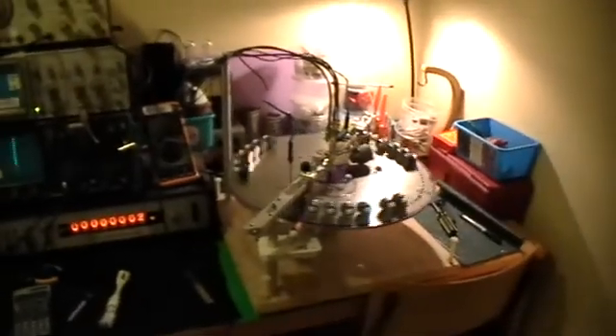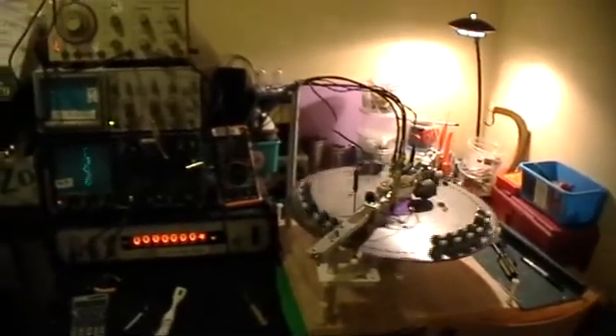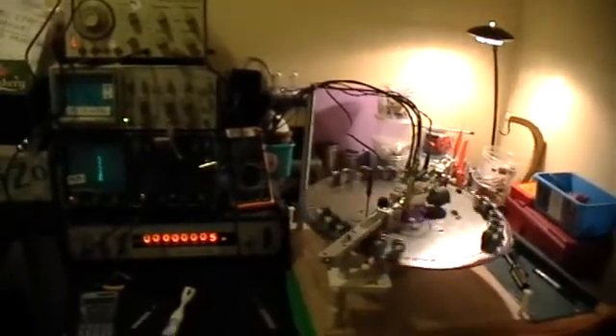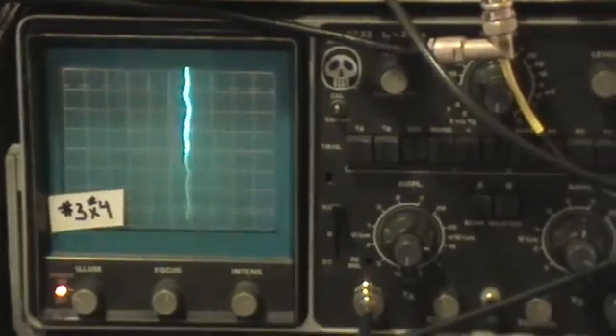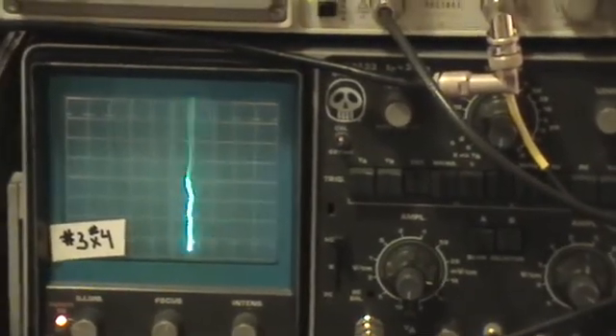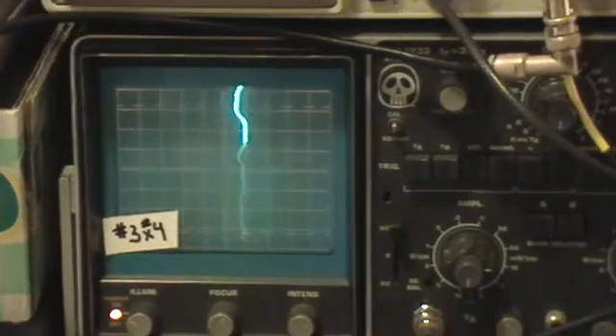The wheel is accelerating. If you didn't know that motor was there and the keepers weren't on the magnet, you might think you were watching an actual magnet motor going. But there are several clues — of course I've shown you the motor. But if you look at the vibration trace, you can see several things: the bearing rumbles from the sideways load, the skipping and chattering of the one-way bearing, and the major contact points as the wheel hits that little piece of tape. We're counting revolutions there — that should be sufficient to show you that there's no splice in the movie.